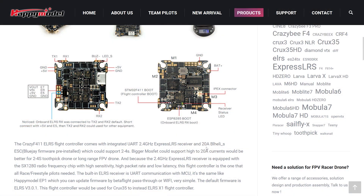As noted on their website: the ExpressLRS receiver is connected to TX2 and RX2. In order to disable it — say it goes bad or you want to use Crossfire or anything else that needs that UART — you can disable it and use RX2 and TX2 by doing a jumper from 5V to E5 right here in blue. Just take a little solder, run it across both pads, make sure it's continuous. That will disable the onboard ExpressLRS so you can use TX2 and RX2 to add your own receiver. Also note: these motor pads aren't really made for soldering motor wires directly. I wouldn't suggest this board if you're going to do motors without connectors — the distance between pads is very small.